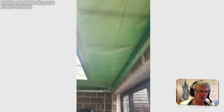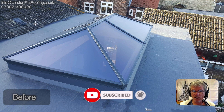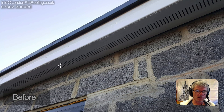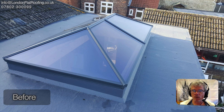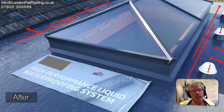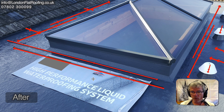When you get the chance to do it properly like he has here — that's really great. Moving now to the outside: this is what it was like before, with one venting tile in the main roof on the left-hand side. He'd already put venting around the outside, but it's no good having a vent across there when it can't vent everywhere else. The air coming up from underneath was dead — it couldn't move anywhere.